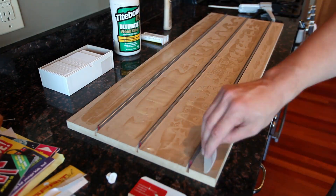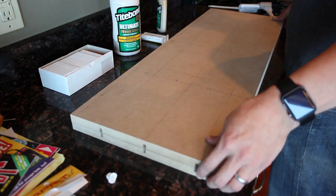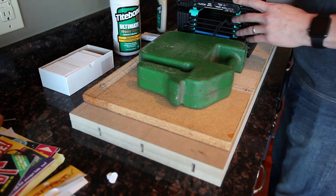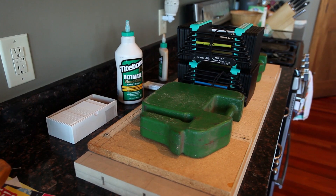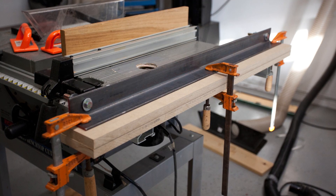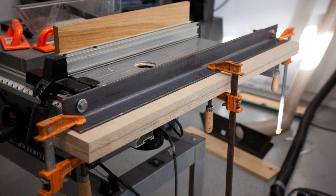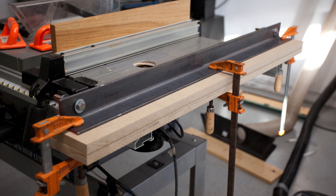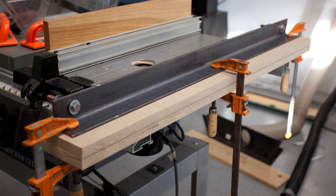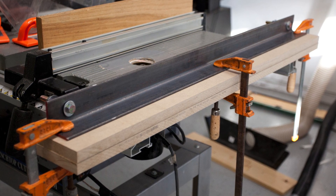When you do this glue-up, you want to make sure you don't use too much glue — I'm trying to use it pretty sparingly, otherwise you can end up with a hump in various places on your table. I wasn't able to put any clamps on the granite countertop, so I ended up stealing a couple of weights off the John Deere tractor and a couple of dumbbells from my wife. My particular saw has a drop leaf on the front, but I didn't end up putting any steel bars inside there. I figured since it was small enough and not as critical as the main table, I'd just glue it together using clamps and a piece of angle iron to keep it flat.